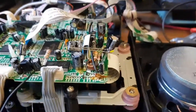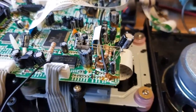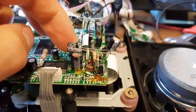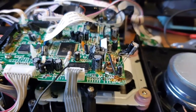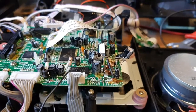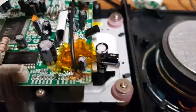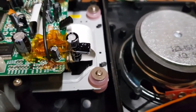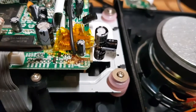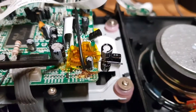Spot the bodge — I've just tacked some capacitors across the inductor which feeds the amplifier, and it seems to be working now. I'm going to change that cap there and I think that might fix it properly. This is the cap I believe has gone bad. I've left the original in circuit because it looks like a complete pain to get this board out.